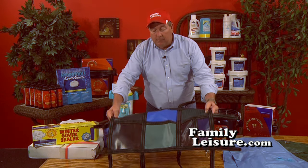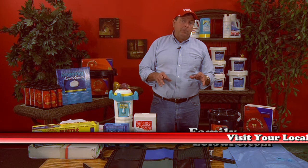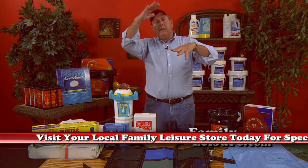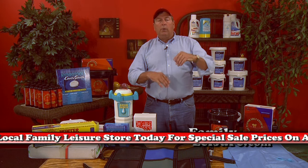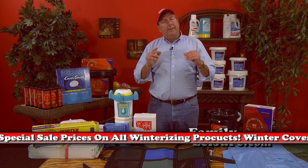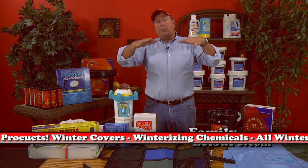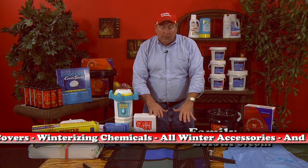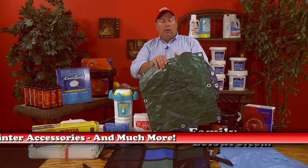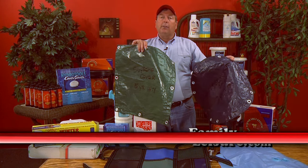Now, I do not recommend something that is kind of popular on in-ground pools, and that's what's called a mesh cover. Mesh covers collect the leaves and the dirt and the debris through the winter, but it lets the water go through. Well, the advantage to that is you never have to remove the water off the cover. The disadvantage is all of the stuff that you wanted to keep out of your pool is now deteriorating and going into the pool. So the cover that I'm going to recommend for you is going to be an 8 by 8 or a 6 by 6 winter cover, either a 3-year or a 5-year warranty.